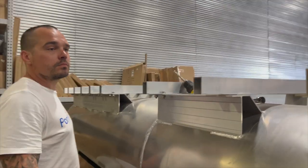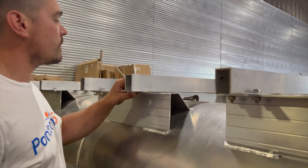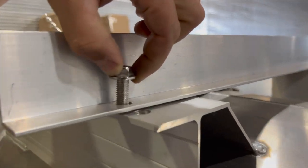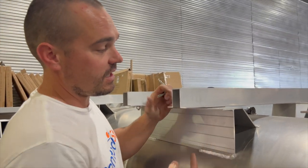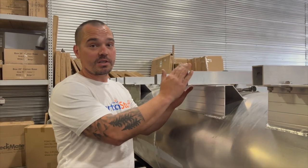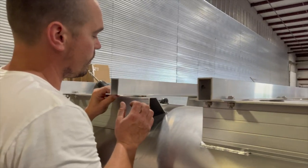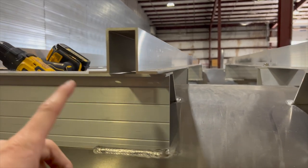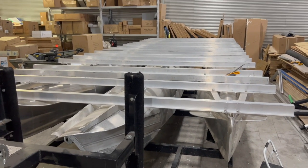Don't tighten down one side of the cross members before you come over and do the other side. On older pontoons there's always a little bit of play — they sometimes have oval machined slots with lots of room. On 30-year-old boats we often have to adjust where the cross members sit because they've shifted over time from the hull flexing, or they were just put on crooked to begin with. Put all the bolts in the holes first, then tighten them down. I spent a whole day tightening one side down and came over to find them really far off — I had to loosen all of them.